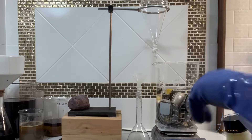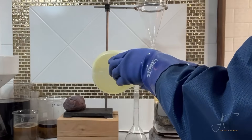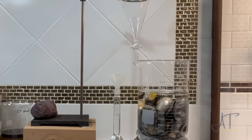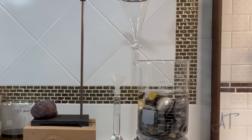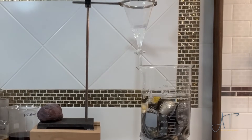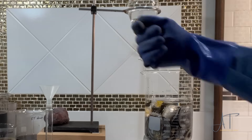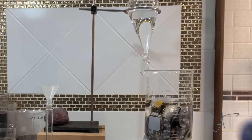Because there's 500 grams of sterling, I'm going to measure out 500 milliliters of 67% nitric acid. I'm going to add this nitric acid to an addition funnel — that way I can set this up and walk away, and when this 500 milliliters runs all the way through we should be pretty close to having all of our silver completely dissolved. I'll go ahead and turn on the hot plate to 250 degrees Celsius and start our drip — about one drip every second.